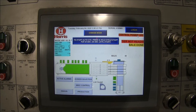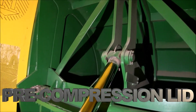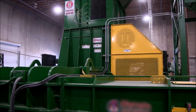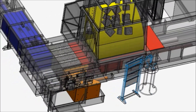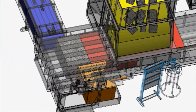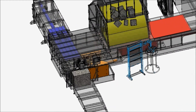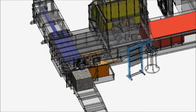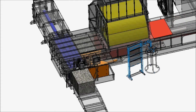Another major feature that sets Harris apart is the pre-compression lid. Notice the pre-compression lid opening and closing in 6 to 8 seconds. The baler continues to strap the bale even with the pre-compression lid operating at the same time. On traditional machines, every time the gathering ram moves forward while baling lightweight containers such as HDPE, PET, and UBC, the material pops up because of how light and loose the containers are.